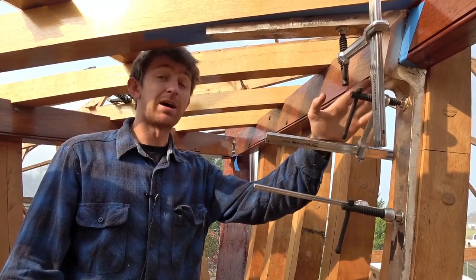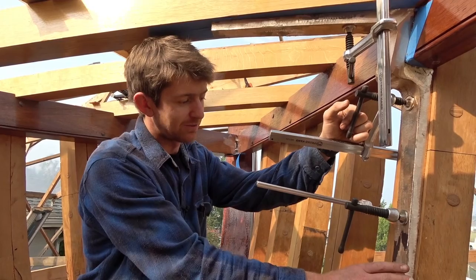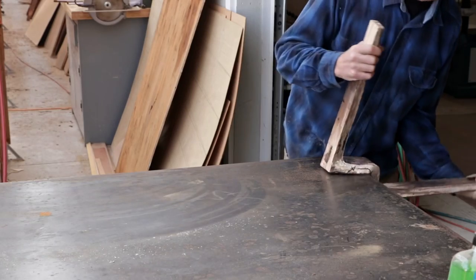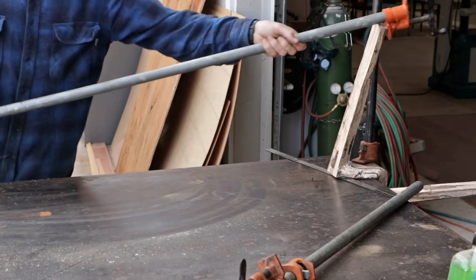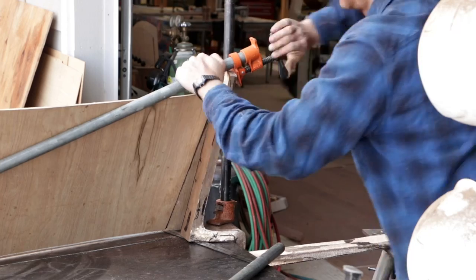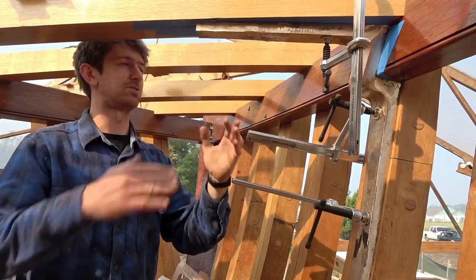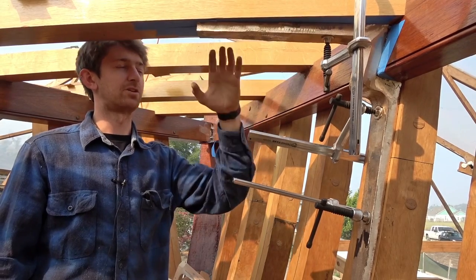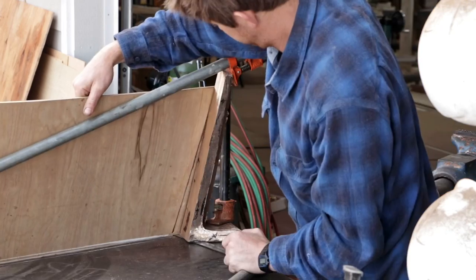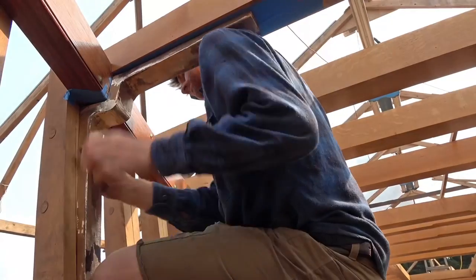So I'm now happy with the fit of this floor. I've ground the back away and it's fitting up nicely against the frame and the deck beam. I did actually bend this one a little bit by clamping it to the table and setting up another clamp and pulling this arm downwards so that I bent them apart, and that actually did work. Although before I bent it, it could actually be clamped into position, this way it naturally follows that shape, which is a little bit better. So now just got to make it pretty and grind the bits that you can see, polish it, sand it.